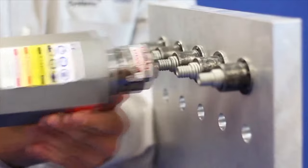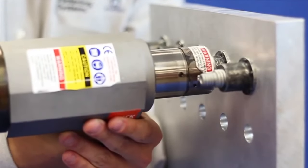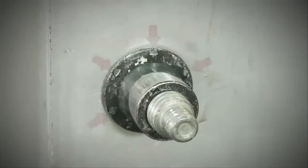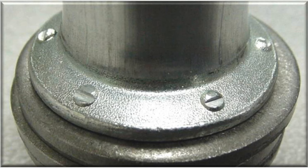With pintail-less lock bolts, there are other ways of verifying installation. The collar is especially designed to have swage indicators on it, so when the installation tooling completes the swage, it deforms the swage indicators, confirming that the anvil — part of the installation tooling — has travelled to its furthest correct extent. Periodic inspection with swage gauges and inspection of the tooling further guarantee a correct installation.